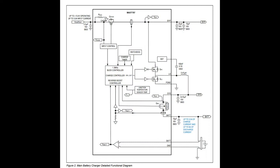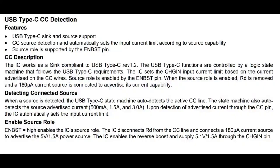Usage is pretty simple. It has current limiting and overcurrent protection. It's meant for big batteries, but you can use it for smaller ones — just set the current limiting lower. It also has multiple float voltages available from 4.1 up to 4.4 volts, supporting different cathode chemistries. Note that it's single-cell only — it will not do 7.2 volts, only approximately 3.7 to 4.2 volt single-cell lithium chargeable batteries.